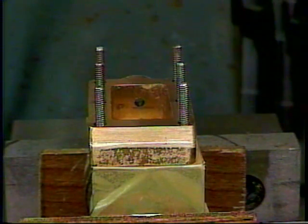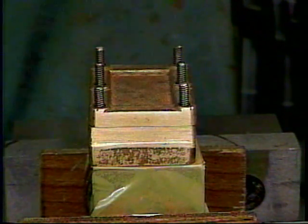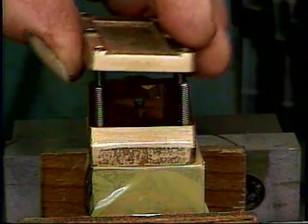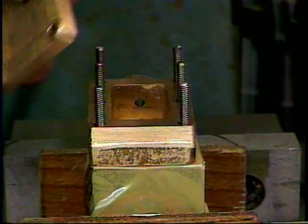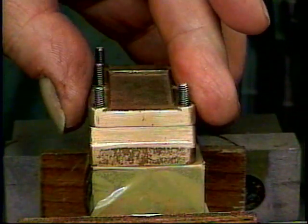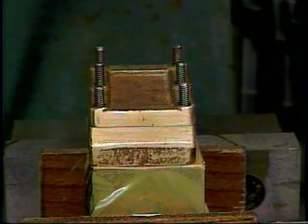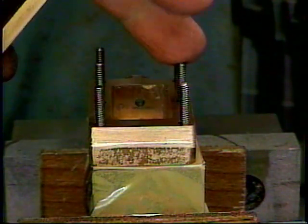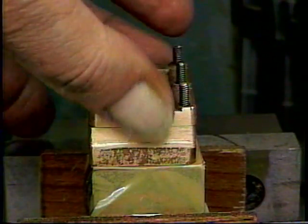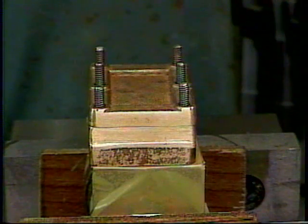Let's have a close look at how the valve chest cover fits. Are those studs in the right place for the valve chest cover? Seems to be. Let's try something here. Let's turn this around. Oh, it looks like they're symmetrical too, because I can mount that valve chest cover that has mounting holes that are just slightly bigger than the studs, and I can mount it in either direction. And just like the valve chest, everything is in the middle of where it's supposed to be.